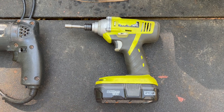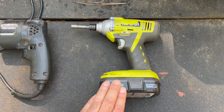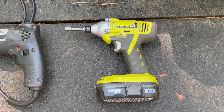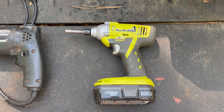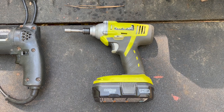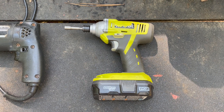I'll do a few practice screws up close to get an idea of what it looks and feels like when the washer and gasket snug up just the right amount. After that it's easy to get a feel for how the gun behaves. You can also use pretty much any cordless drill or screw gun. I will caution you against relying on the slip clutch on a modern cordless drill — those slip clutches are not consistent, and wood isn't consistent either, so you'll spend all your time messing with that clutch setting. Skip the clutch and use your eyes and feel instead.